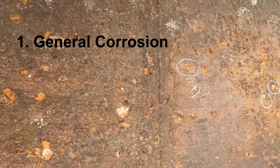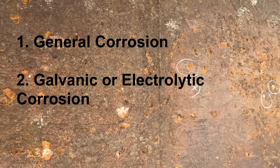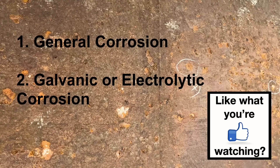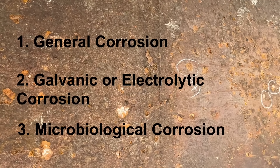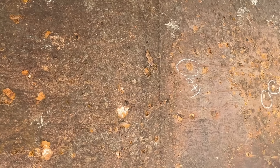In simple terms there are three main types of corrosion I'm looking for in a survey. The first is general corrosion of steel, resulting in the rough surface and flakes of brown rust most people are familiar with. The second is galvanic corrosion caused by dissimilar metals electrically connected through water, or electrolytic corrosion caused by some form of electrical stimulus. The third is microbiological corrosion caused by one of several bacteria and microorganisms. Interestingly, on this plate I think we have something from all three groups.